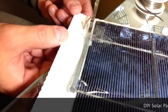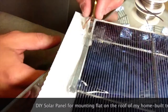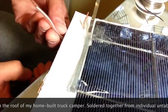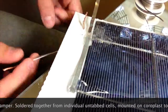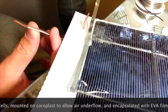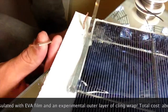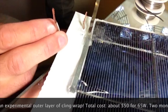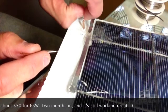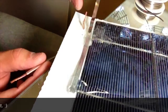Not connecting to the bus terminals, but how I connect the wires to the solar panel and what I do with it. So here's the bus wire, and what I'm doing is I take this little pigtail, this little 16 gauge wire. Generally you want to run really big wires from your solar panels, at least 10 gauge. But another thing you can do is use really short lengths of smaller wire, because there's very little voltage drop across this very short length — way less than a tenth of a volt, more along the lines of a hundredth of a volt.